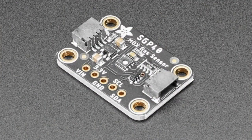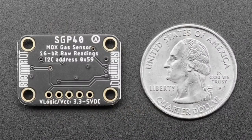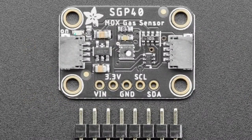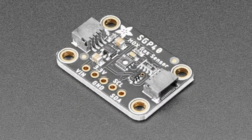The star of the show tonight is the SGP40, which is the next generation of gas sensors from Sensirion. It has a built-in gas sensing element with a protective top — it heats up a doped piece of silicon and can detect volatile organic compounds. This is good for detecting rotting fruit, alcohols in the air, or off-gassing from laser cutting materials. It's not good for particulate sensing — that's a PM2.5 sensor, which we also stock. The SGP40 is I2C and very similar to the SGP30.